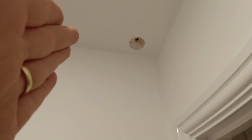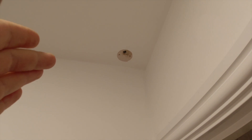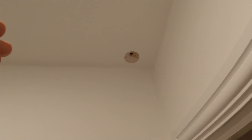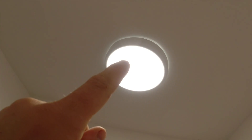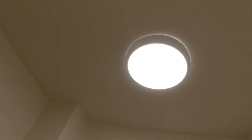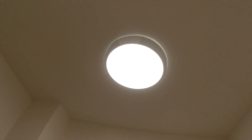Kinetic switch is done. It's going to flicker a little bit, and then I've just got to bang a bit of filler on there for the client. That's an easy way of getting over having a pull cord - if you want to get rid of the pull cord, put in a switch using the wireless system. If you wanted to put spotlights in here, you'd have to hide the kinetic receiver behind and put a note on the fuse board saying which line it is and do not make live. Simple as that - take care and I'll see you on the next one.